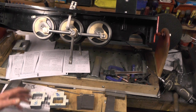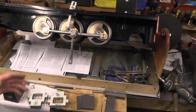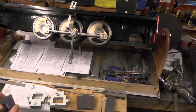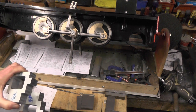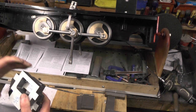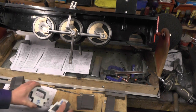I'm moving on to drilling the holes now in the cylinders and the valve chest. In my last clips you'll have seen me getting my cylinders made into shape and the hole bored in. I've now also finished the valve chest - they just want this end turning on where the glands go for the spindle where it comes through, but they're all to shape now.